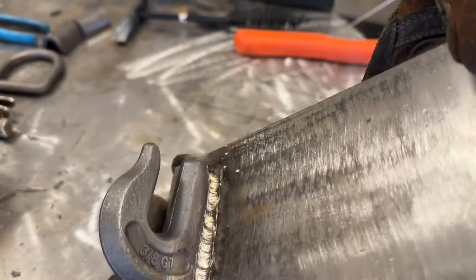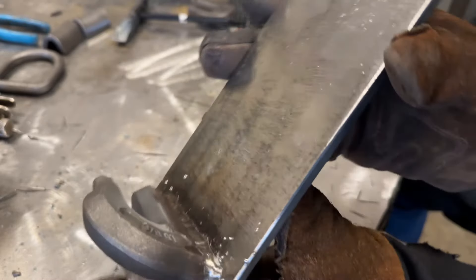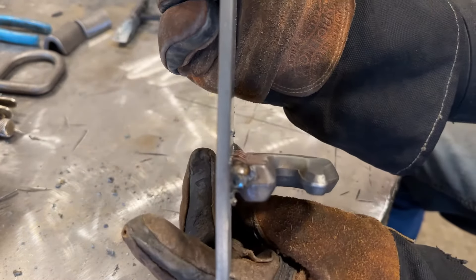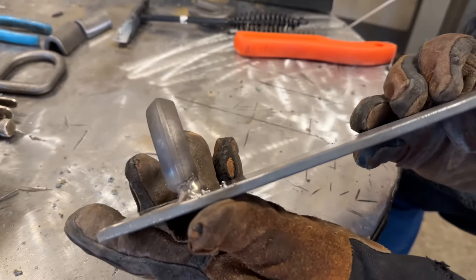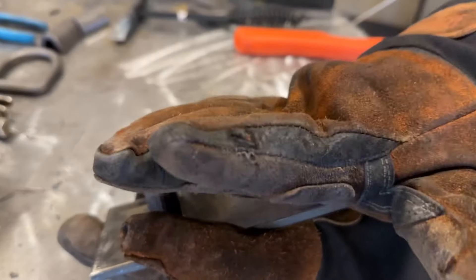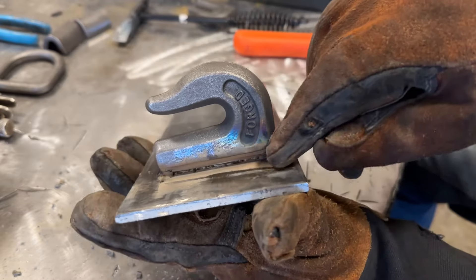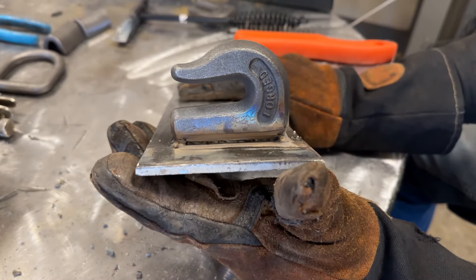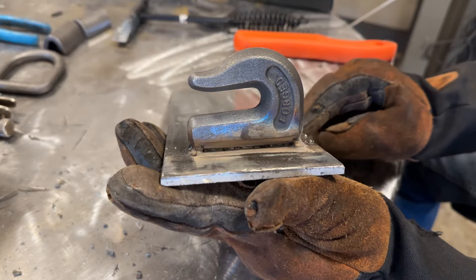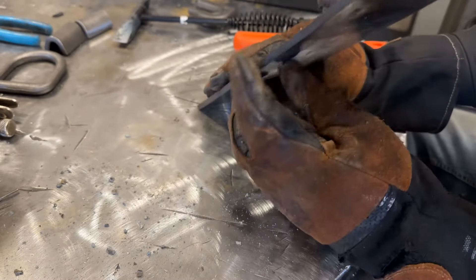Cleaned up real nice. We no longer had an issue welding into the forged part - a lot of that is simply because it was heated up. Our tacks are still there. The hook is virtually straight now, still has a little cant, but the plate is actually starting to warp up - that's realistically why it's still slightly off. I'm going to clean it with the brush, same settings: 105 amps, 3/32, two more passes, and then we'll touch up the tack on the end.